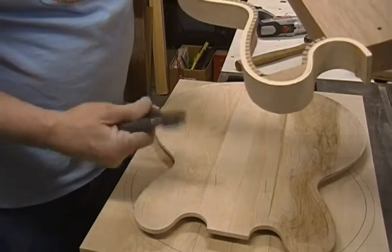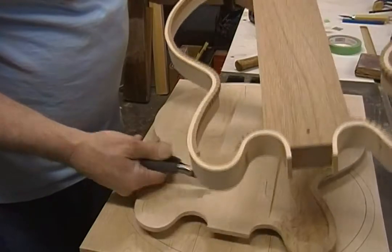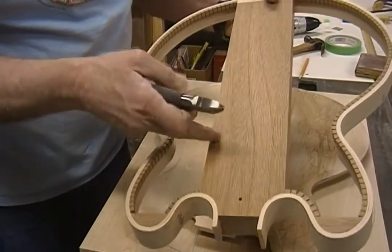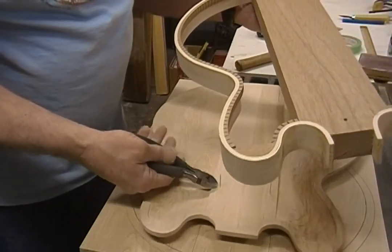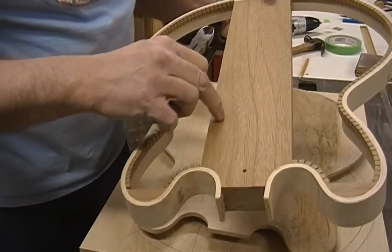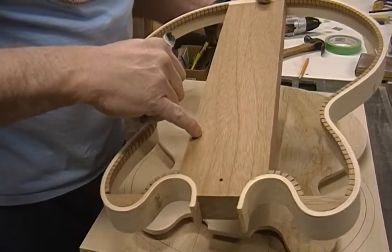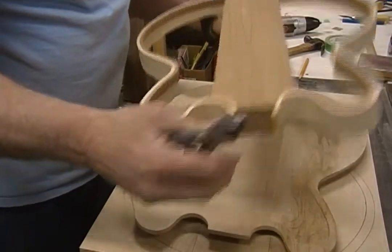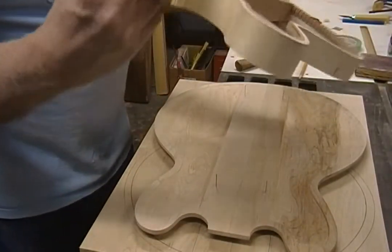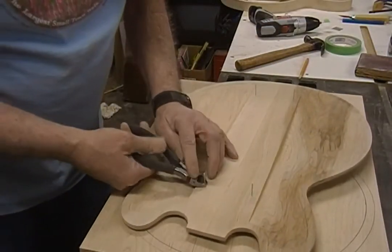So if I cut these brads off perpendicular to the grain this way, then the wedge is going front to back, the wedge that I leave from nipping that off. If I were to cut them off this way, then the wedge would be going into the grain lengthwise and could very realistically pull me off of where I want to land with that. So I'm cutting them off the other way so that I can set this up, get it right where I want it, and then push it down, and it'll stay where I push it down. It won't drift because I'm cutting these off this way.